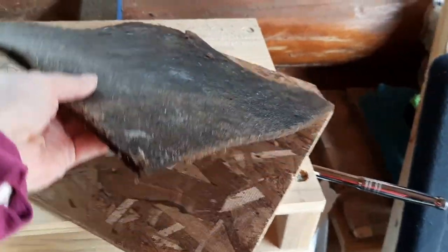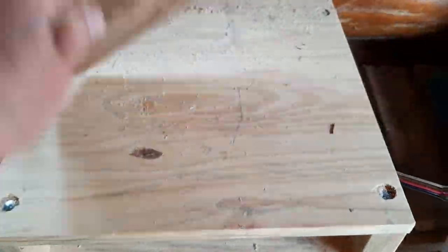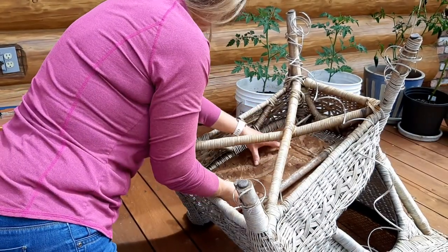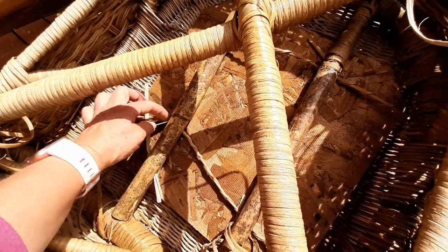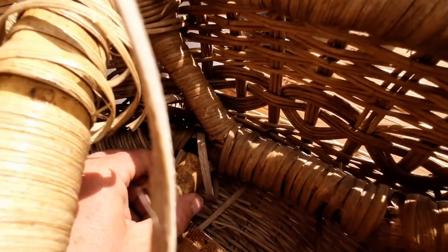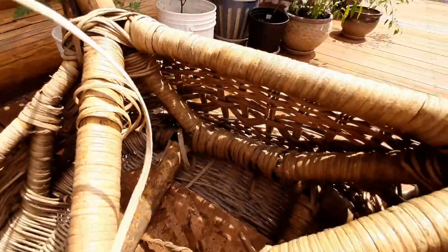So I have taken this off of the chair and, using it as a template, I made this one. I've replaced the piece of wood — I need to tighten up these little guys a little bit. And then the bamboo here I managed to get on, but there's a little splint because the nail was sticking out and there was no way of redoing it. So I had to kind of split it apart and twist it in there. But I think if we super glue it, wood glue it, and then cane it really well, that should at least give it a couple years.